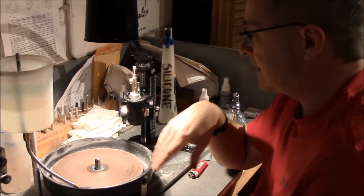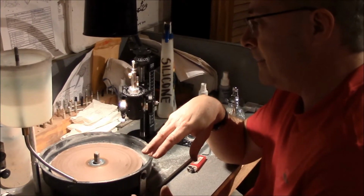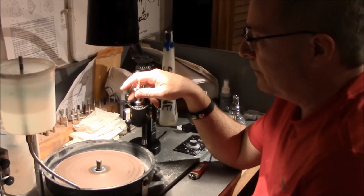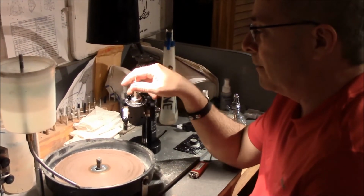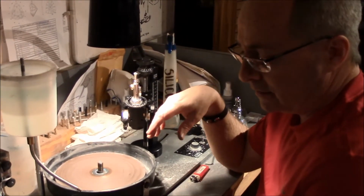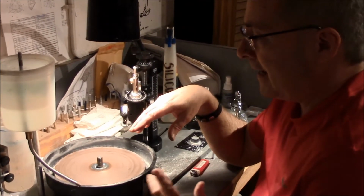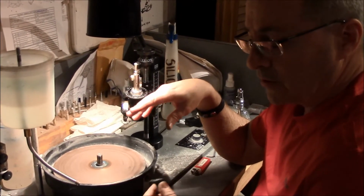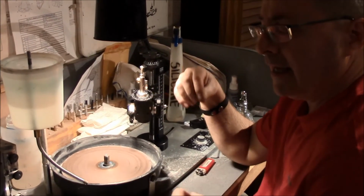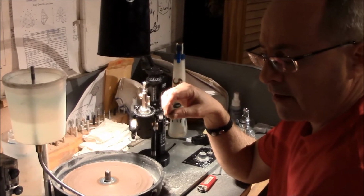This is a Montana Sapphire that I probably got 7 or 8 years ago. It's unheated, it's a mint green. It's probably going to be somewhere in a 6.5mm round. It'll probably be a 1.25 carat to a 1.5 carat, depending on my crown angles I can get by with. I try to do my crown mains at 36 to 40 degrees. Lighter material, I can go a little steeper and it'll give a little more scintillation or sparkle off the crown facets.